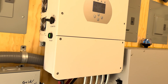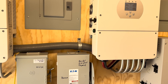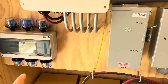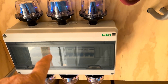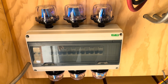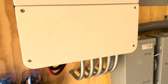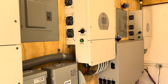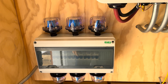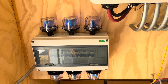So let's talk about this. The solar comes in through conduit from those panels, and there's a connection box — a junction box — behind this disconnect box. This disconnect box has breakers for each of six circuits. Each of these inverters has two MPPTs, so we have six circuits of solar coming in, and each one is protected by its own Midnight Solar surge protection device.